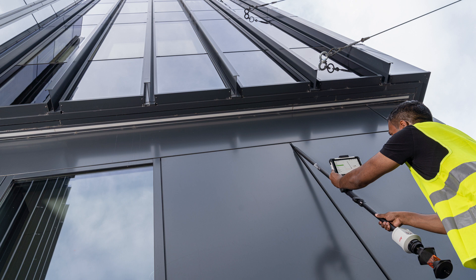You can also turn the pole directly upside down — there's a toggle inside the software to project the pole height to the top or bottom of the pole. There are some cool accessories, like tips you can put on top of the GRZ122, the Pro 360 prism, which has a 5/8 thread on top, so you can do staking from a much lower rod height very quickly. This allows three to four millimeter accuracy shots in concrete, done very quickly.